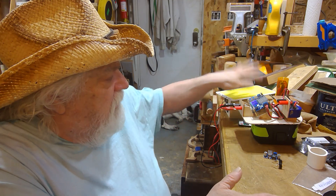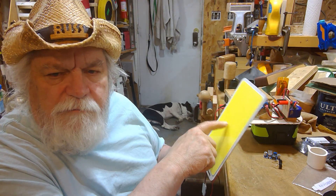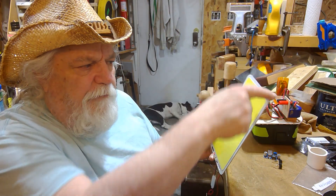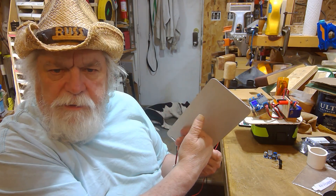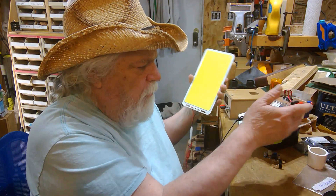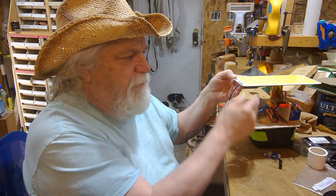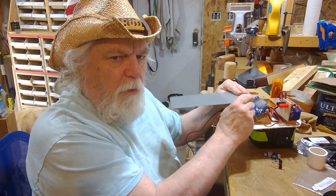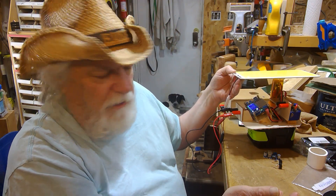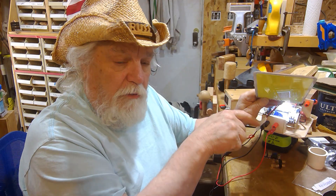The back of this light is made of aluminum — it's the heat sink — so when running full blast it gets a little warm. I'm going to encase it in a frame, like a picture frame, so the back is completely open and the heat sink can breathe. That frame will mount onto my box, which sits down on the battery. I'll have it on a pivot so it can swing all the way up or all the way forward.